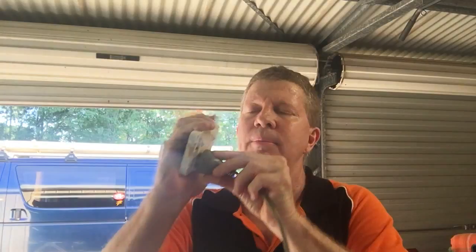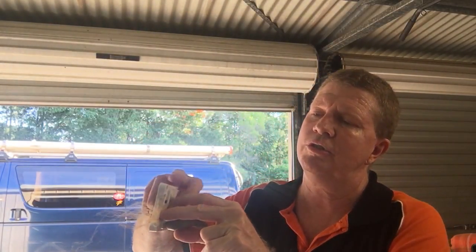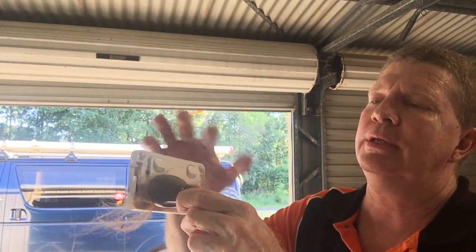We're dealing with bits of hair and lint that has built up over time and is sitting across the two pins, like such. It's a bit of an exaggeration, but you see my point. Straight across the terminals, it builds up a little bit of heat, it's got plenty of oxygen, and heat, fuel, oxygen, fire. So, what can you do about it?